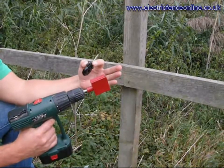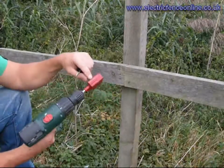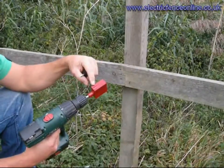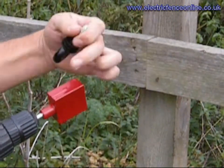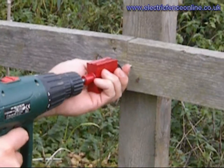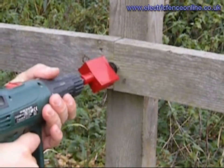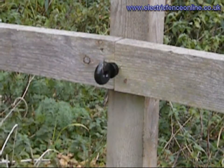When you're buying bulk buckets, the CS1 chuck will come free with those. With the insulator chuck, you've got a little line on the top, which indicates that's the top of your insulator. Always have the groove of the insulator in line with that. You simply slot it in up to your wooden post, get your line in line with the top, and you know you're in the right place.